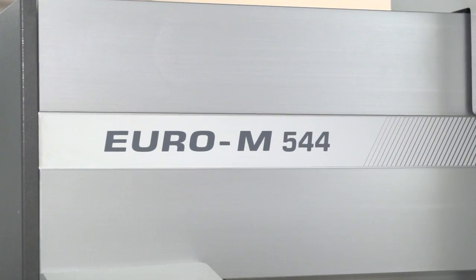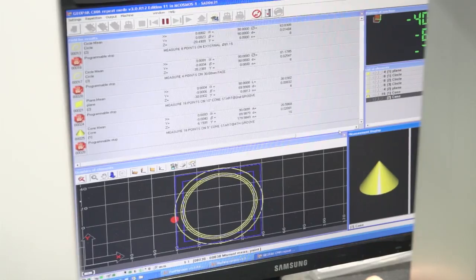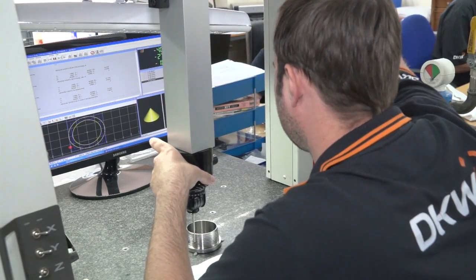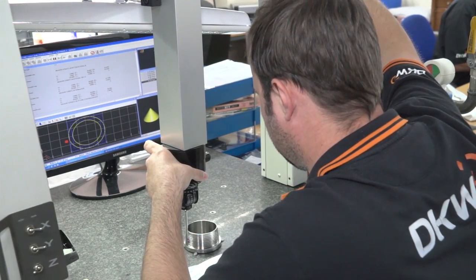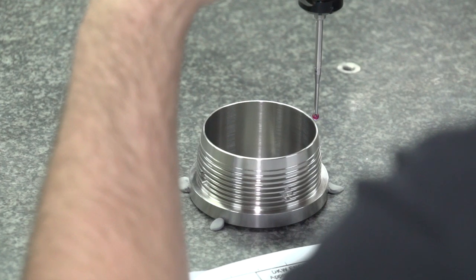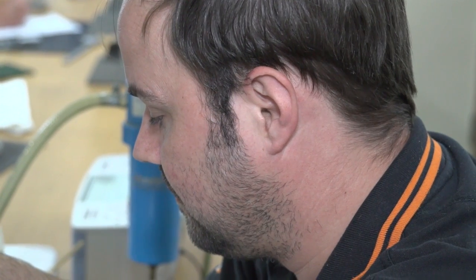One of the biggest products you have here is the Mitutoyo CMM. Could you tell us a little bit more about how you get on with this product? We've had it now about 19 years, so we're pretty familiar with it — Mitutoyo is a good make. We are now looking to expand and get a CNC CMM. Hopefully we can make that purchase, that next step up. And why is that? For speed really. It's ideal having two as well, because the lads can still use the other one for simple checks. But with the CNC version, we can multi-load it and it'll be a lot quicker.